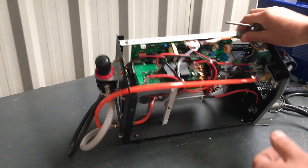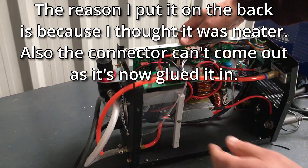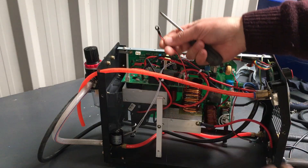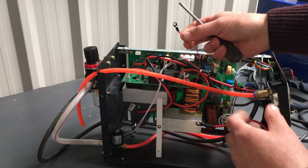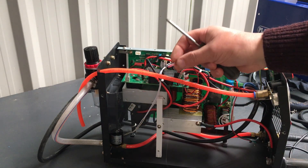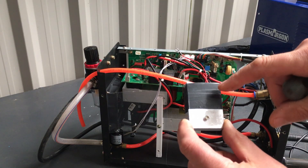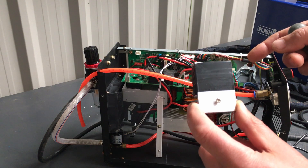Right, so we're into it again and there's my little modification there. I'm just going to disconnect the thermocouple again. So I'm just going to get a heatsink and we'll screw it onto an external heatsink — just a small one, so it'll be easier to heat that up and down instead of heating up this big block under here. I've also put a bit of black tape on it here because we can then use the thermal camera and actually measure what temperatures this unit will cut out at.